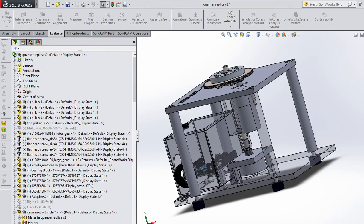Okay? One more hint. When you bandsaw a piece of material, the edges are rough. You're going to use a milling machine and end mills that you've learned about in these tooling quizzes to cut it much more accurately and much more smoothly. So you're going to cut this part off, so you need to leave some room between here and there so that there is something to cut off. See what I mean? But it can't be so much room that these won't fit in this plate. Also, the bandsaw blade has a thickness, right? So you need to be careful cutting these out.